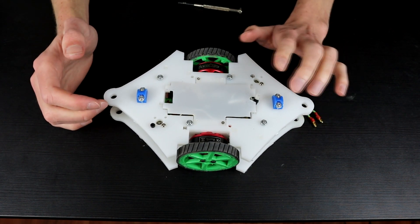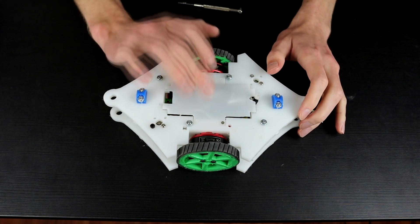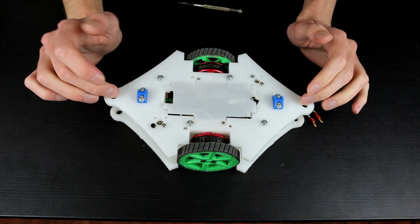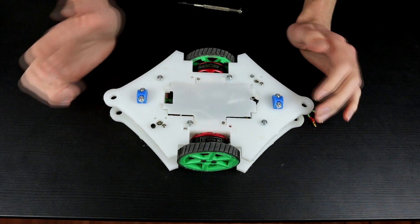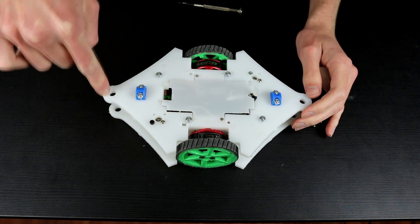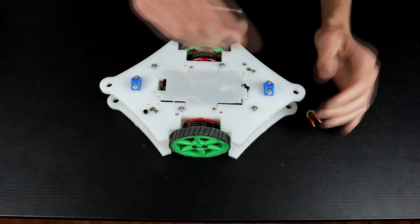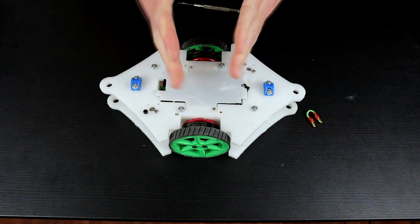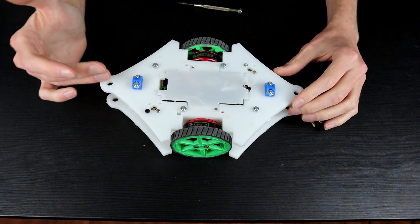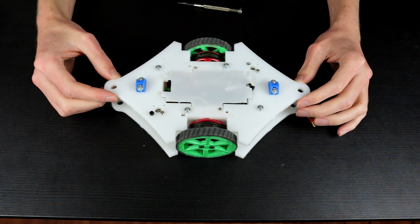I think the issue is light drift because our maths isn't exactly right, which I can tweak. I also think it's because currently the motors are on for too much of the arc. The way meltys work is: if you want to go in a direction, you've got an arc where you turn the wheels on to add extra power. Currently I'm using the full 180-degree arc, but I probably should only be using 60 to 90 degrees inside that arc, because with the melty heading not being perfectly fixed, that would help lower the creep and the robot moving off the right angle.